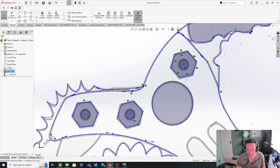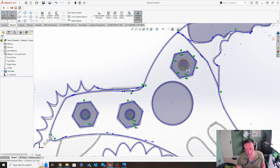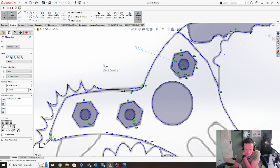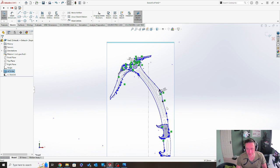And what I'd like to do finally is, in fact, see my internal construction lines here, here, and here, make them equal. And here and here, make them equal. Now we're just going to experiment. So let's come in and see how big that is. 5.1, so it's an M5. There you go. Let's say it's going to be bigger. Let's go six. See that? Consistent change, consistent update. So we're now starting to look, dare I say, pretty cool. And we've now got that overall control piece there.